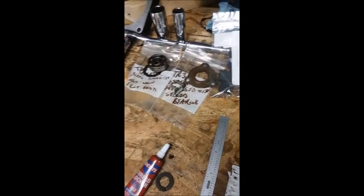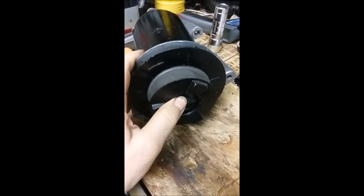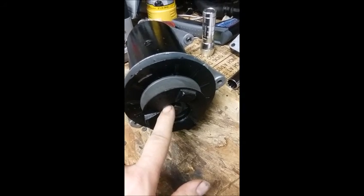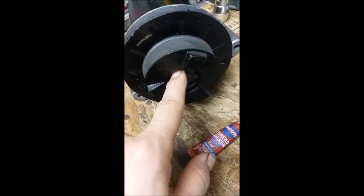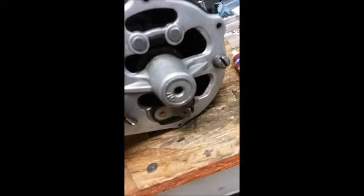The other thing that happened: in putting this nut back on, the nut would just barely clear there, and there wasn't enough thread left that I felt comfortable putting a lock washer under there. So I elected instead to use Loctite on it. I thought, well, maybe this is out of line — maybe the armature isn't sitting in there properly spaced — so I did one last check.